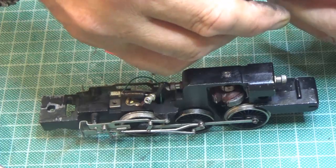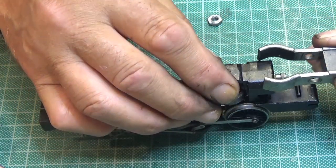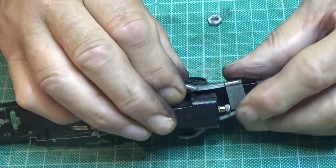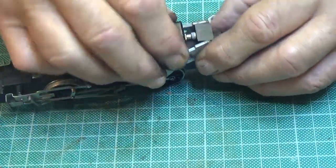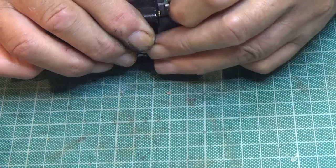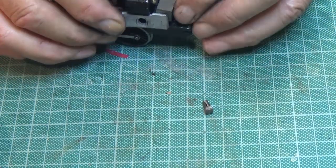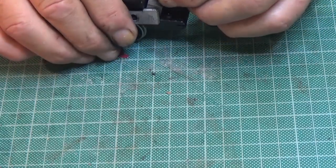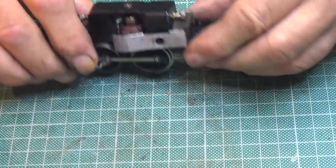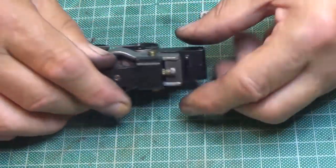And also this head of the bolt was on this side and the nut was on this side. So I'm going to try and slide this assembly over the armature and into position without removing them, if I can. But it actually looks as if this brush pin is getting in the road, so take that out, fit it in, locate those there, and then put the brush holder back in again. There we go. So let me line this up, that in there, there we go, into there.